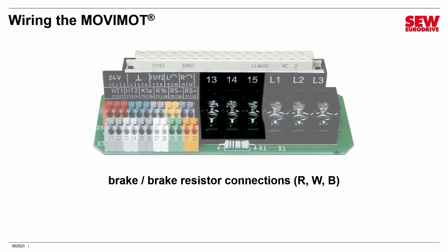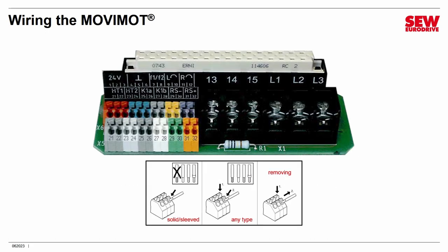All remaining connections are low-voltage connections that operate around 24 volts DC or less. On the colored terminal blocks: if you have solid wire or a sleeve or ferrule, you can push them straight in. But if you have stranded wire, you need to push the little release mechanism above with a small flat-bladed screwdriver in order to insert the wire — otherwise the strands will go everywhere. To remove any type of wire, press the release and pull the wire out.